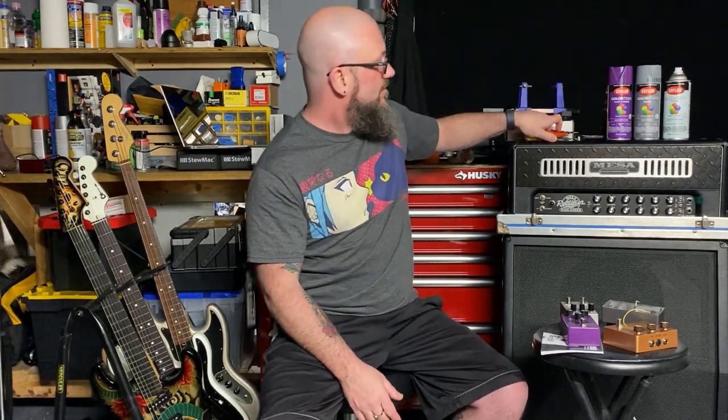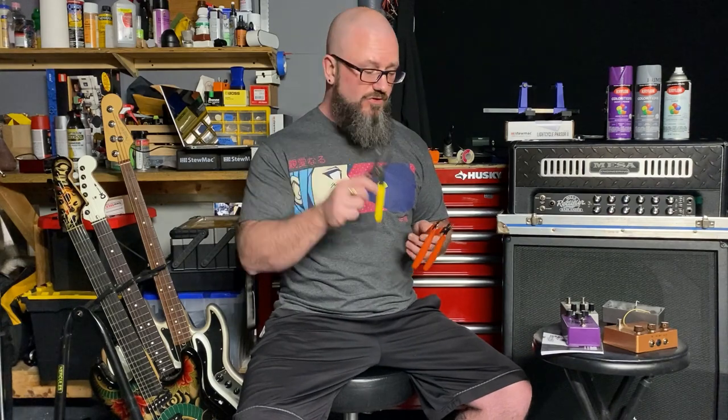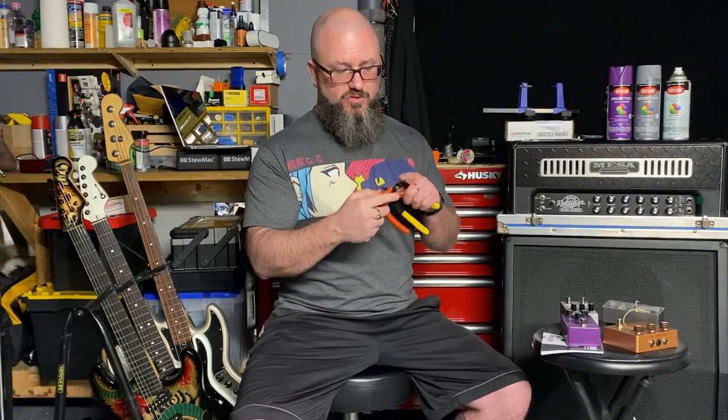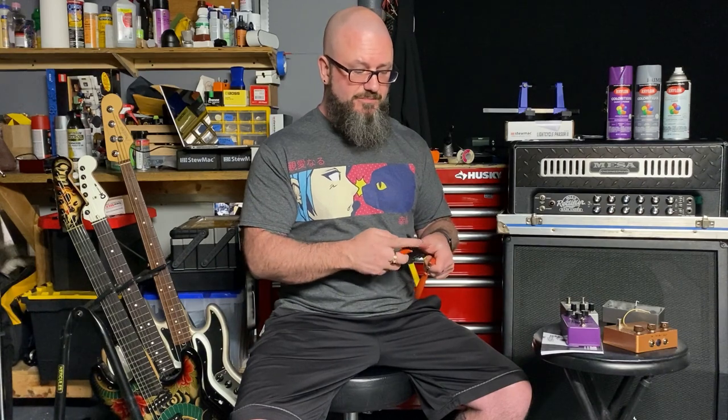In addition, these will come in super handy. These are the thin wrenches. They are great for tightening the DC jack inside the nut in there. Wire strippers, you'll have to have that. I have these small pliers made by a company called Crescent, and they're small and they have a rounding on this. So they're perfect for rounding a component. In this build, you will bend photo resistors over and you don't want to damage them. So this is a perfect way.